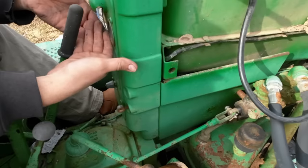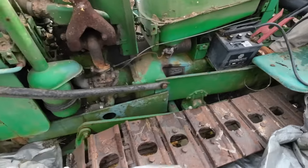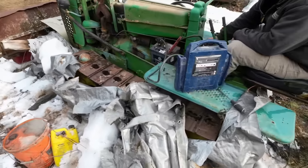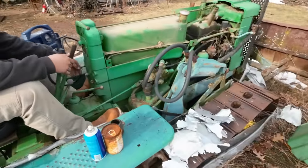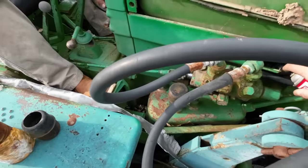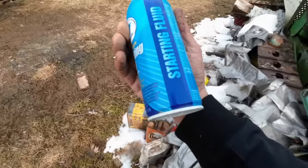See that? Oh, yeah. Well, let's see if we can get that to happen over here on the battery, because maybe we're just having a bad connection. Hold on. Put your finger in there, man. Okay, we got a little jump here. Hold on. Now you got it going. There we go. Where was that, Kurt? It was just that button? It must have been seized up. I was pushing it towards him. I is for ignition. We got ignition, we got lights. I just cleaned it off with the electronics cleaner. Here we go.